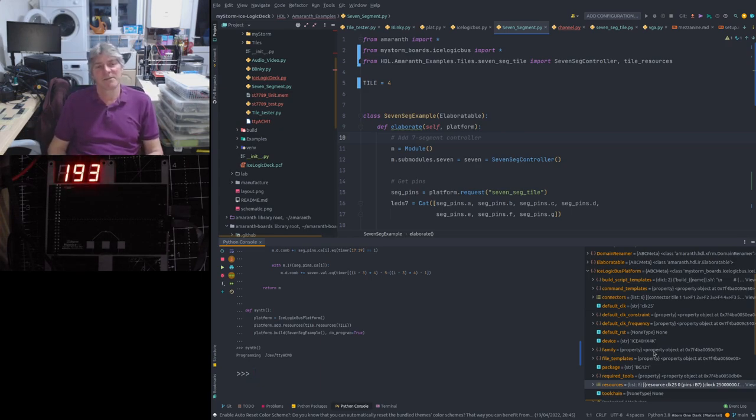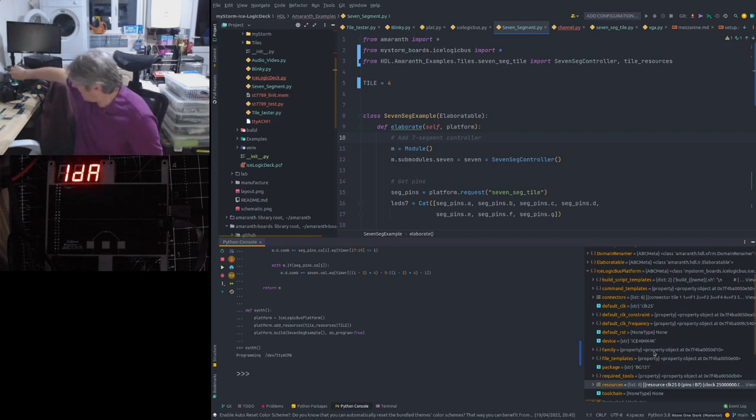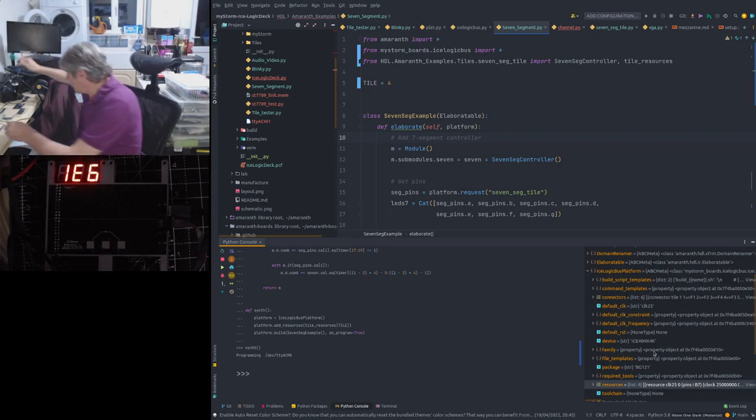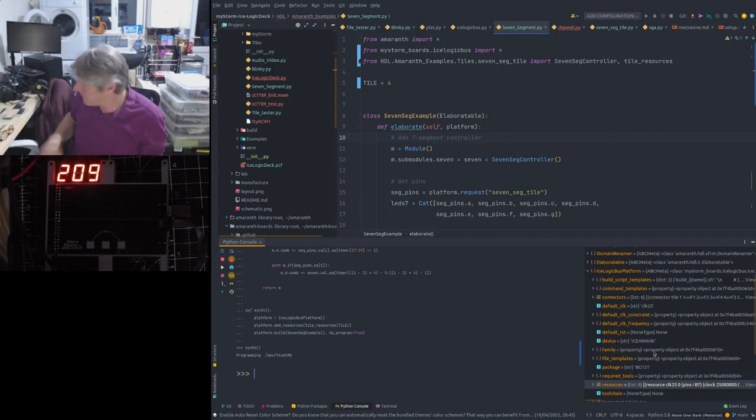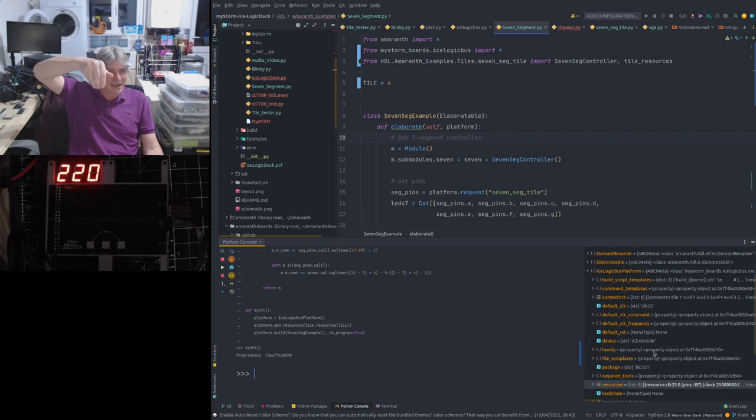Unfortunately, these connectors are difficult to reheat again, because they're liable to melting, particularly when you're using a hot air pencil to try and fix things. So I half fixed them with a combination of the hot air pencil and other tools, but that wasn't good enough. I knew some of the connections were bad, so I went over them today with the good old soldering iron and lots of flux to get much better connections, which I duly did. I'm confident that those are pretty good, although one of them I know is slightly dodgy, because it's at a slight angle, slightly twisted. So when you put the tile on and try and fit one in, it's twisted and under tension, and that's not good.